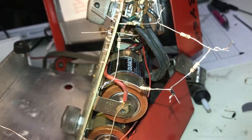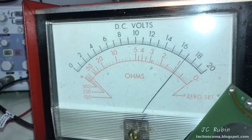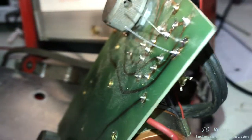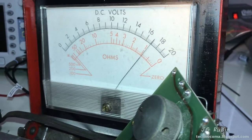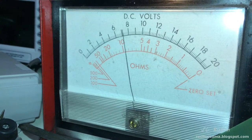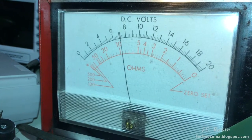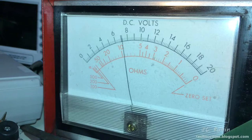I've cleaned up the connections, made them tighter, and soldered them all together. It lowered the resistance ever so slightly and I've recovered almost half a graticule — almost on the one. The x10 is also just under one graticule low, and there's nothing I can do about it. I've given this meter as much attention as it deserves. It works as a multimeter, very sensitive on ohms, and that's about as far as calibration goes. Voltage works. We're going to close it up and call it a day.